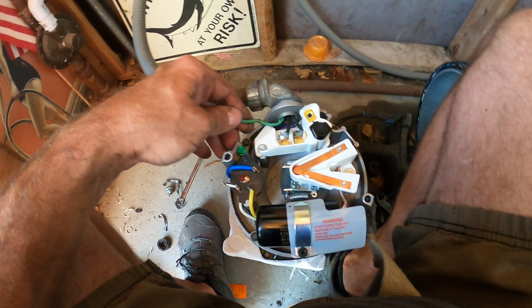If you're wiring off a single breaker which is 115 volts, you're going to have one hot and one common, which is normally white, instead of two hots. On this Sentry motor I'm wiring, the common (white) goes to terminal L2 and the hot lead goes to L1. There's usually a diagram on the outside casing of the motor to help you wire it up to 115.